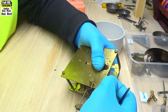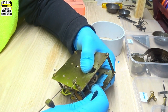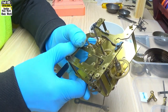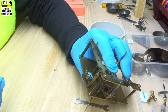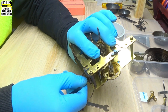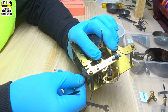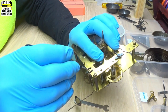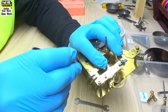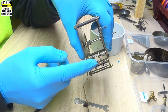Warning wheel pivot — that one there — looks pretty good. And the fly — that one there. This movement hasn't done very much work. A lot of these haven't been re-bushed and they're quite acceptable. Warning wheel — we might have to redo that one. I think it's a little bit loose. That's alright, well I'll mark that. Plenty of end play, you can see.